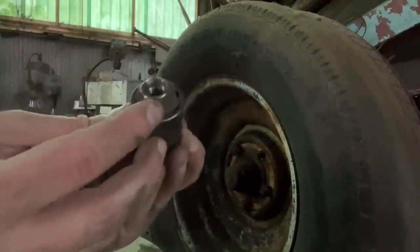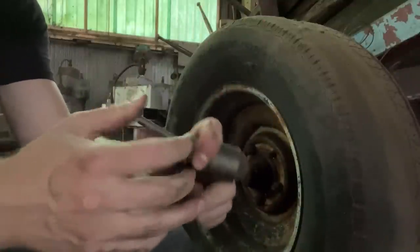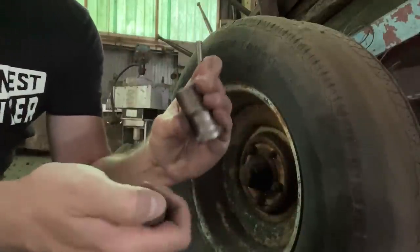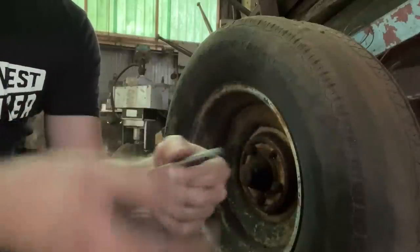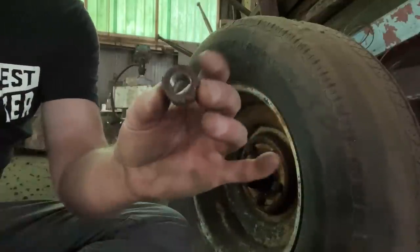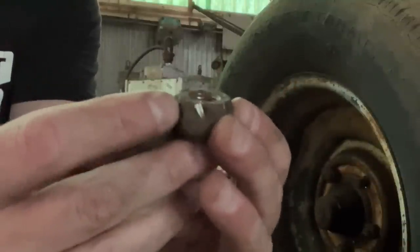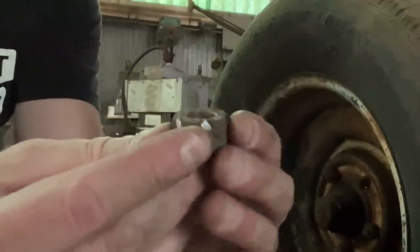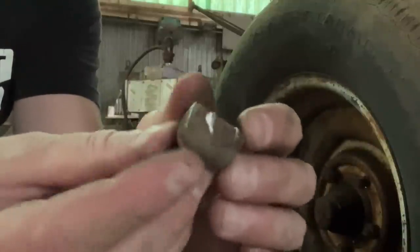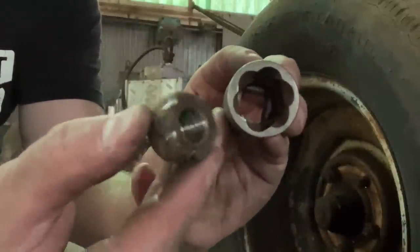Look at the shape deformation here — it looks like a round ball. Using the push pin again to eject it, and there's the extractor. Plenty of rust in there, and there is the bolt that I just extracted. You can see quite a bit of rounding and deformation on this one and also where the extractor really bit in — it left bigger grooves because there's more rust and metal fatigue. The metal is softer, but it did bite in at the contact points and used that counter-rotational grip to really lock in and get it turning.